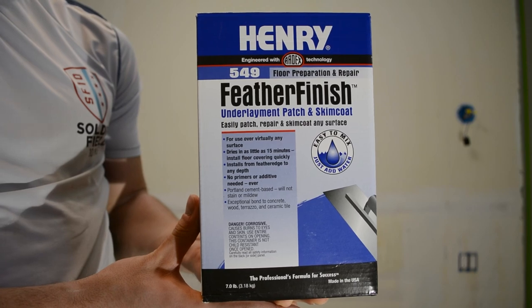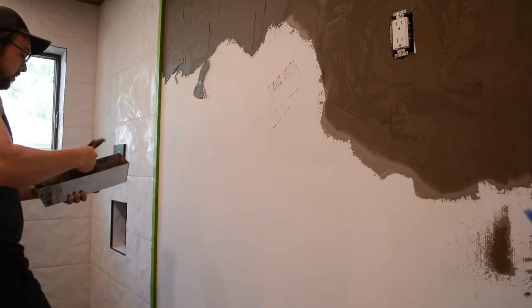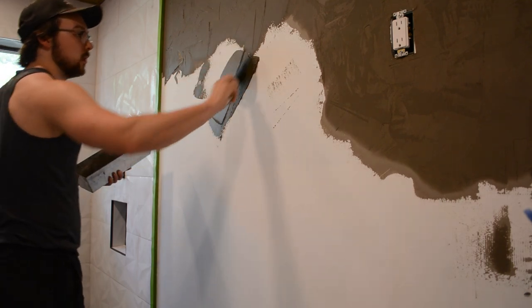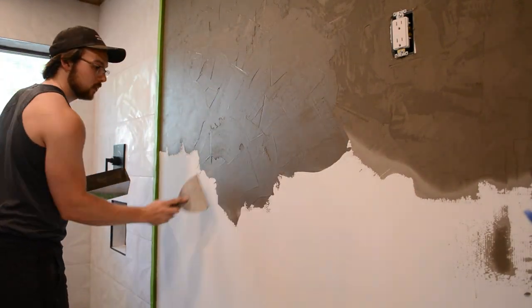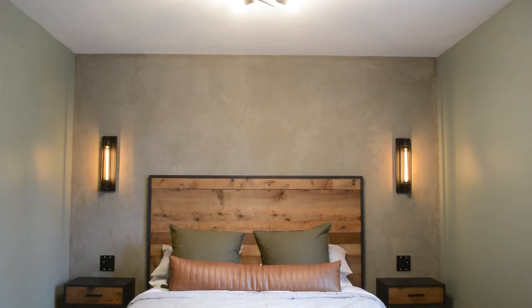Once all the walls were painted, I used Henry's Feather Finish to create a concrete accent wall. This stuff is extremely easy to apply, you just have to keep in mind that it dries pretty quick, but all you need to do is add water to the mixture and then you can use a drywall knife to just spread it around. It's pretty artistic and pretty forgiving, so it's kind of up to the eye of the beholder on this sort of stuff, but I've used it in a lot of projects in the past